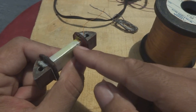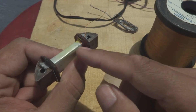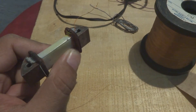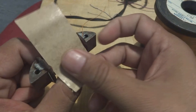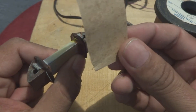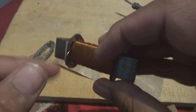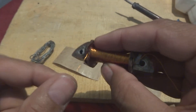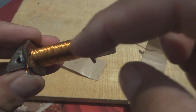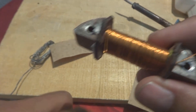After 500 turns, we have to give an insulation paper layer, something like this — we will give it. I will show you how we are going to put this insulation layer after 500 turns. Now we have completed just 500 turns on this former, as you can see. The winding goes procedurally from here to there. Now is the time for the insulation paper — we have to use mylar paper, or anything like that.